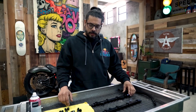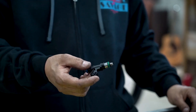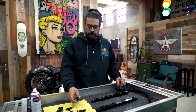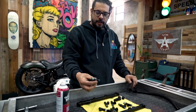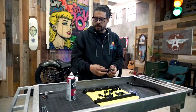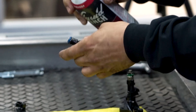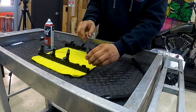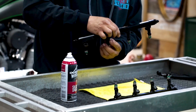We're prepping our fuel rails. We're going to use slightly larger fuel injectors — these are out of a GT500, keeping it in the Ford family. Those from the factory are boosted applications so they're going to work great for what we're doing. When installing any kind of injector or rubber seal or o-ring, always use lubrication. I like to use a silicone spray in an aerosol can. Without lubrication you can run into a seal getting caught on a sharp edge, ripping, tearing, or even rolling off the injector.